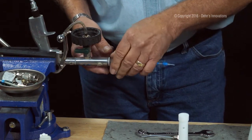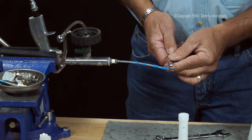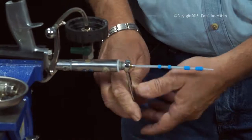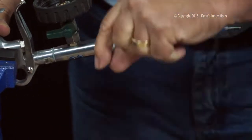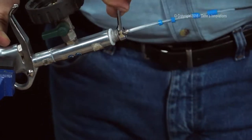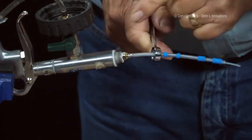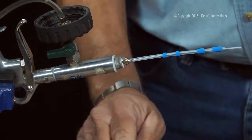It's not necessary. Okay, now I'm going to take that, get my box end wrench, 10 millimeter, slide that on there. I'm just going to tighten this down. It's important to make sure that when we notice those threads at the beginning, that they were clean and there was no obstruction, because we want this to tighten down nice and even, just like that.